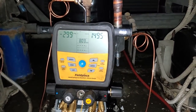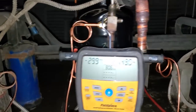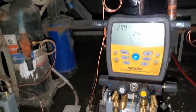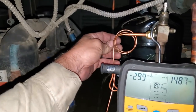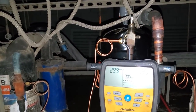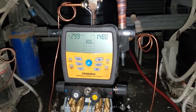Currently charging it right now. It held a pretty good vacuum — it pulled down to about 600 microns. I can't wait any longer — we're going to get this guy going. Just went ahead and opened it up and we're just charging as much liquid as we can into the receiver. We're at six pounds. The total charge on this guy is 25.2 pounds, so we're going to go ahead and weigh in the factory charge. They calculated that to be the right amount for the head pressure control valve with the line set length and everything. It's kind of nice on some of these refrigeration systems when they have that calculation for you. But if you ever do go through the process of figuring out the calculation, it's always good to write it down for the next guy so when it comes to something like this, they got what they need and they can just charge it up.